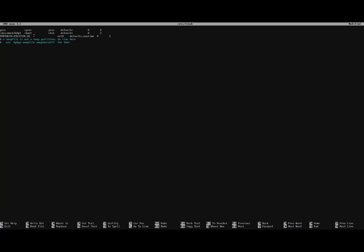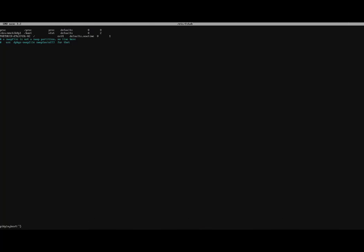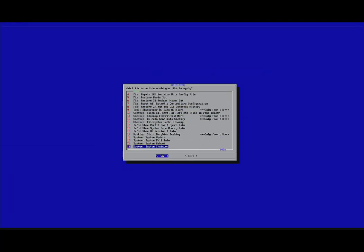As I said, this will make the Raspberry Pi use the correct boot partition — in our case the one located on the SD card. You're going to have the correct info, and in my case because it's a 2 gig SD card, you'll see about 2 gigs instead of the usual 256 megs partition. I'm starting the Playbox toolkit and I'm going to reboot.